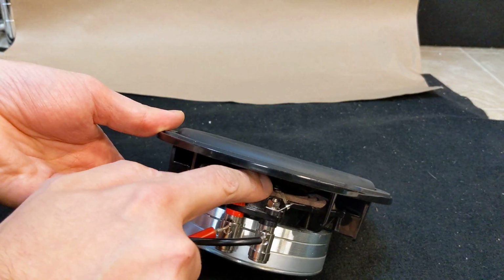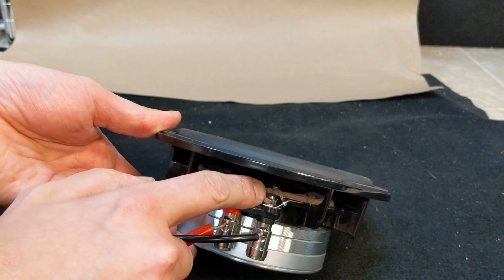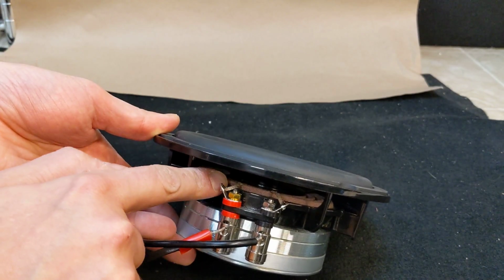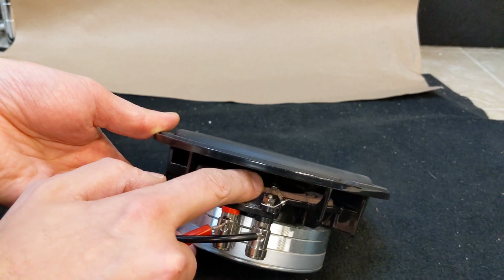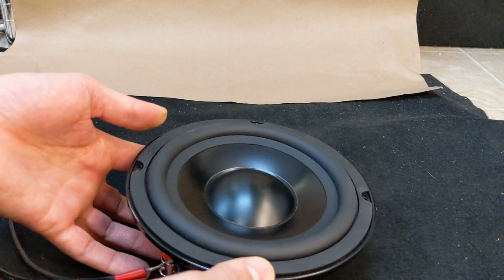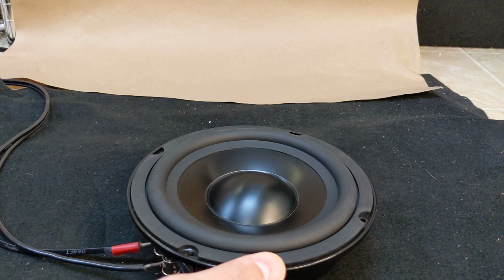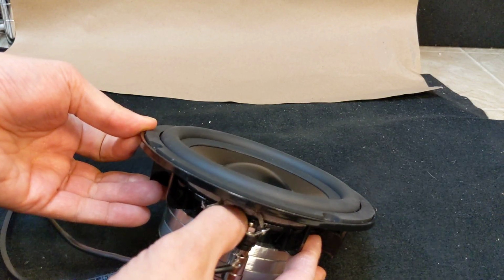those spider leads inside here. It'll hit there at pretty much 11. It's like 10.8, I believe, or 10.5. So that's literally exceeding the limits of the basket. And we don't want it to be linear out that far, or else you guys will just basically destroy the driver, because you won't hear any signs of stress until it smacks itself on those landings, and we don't want that.